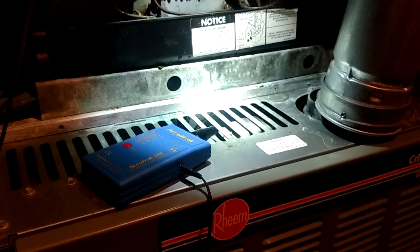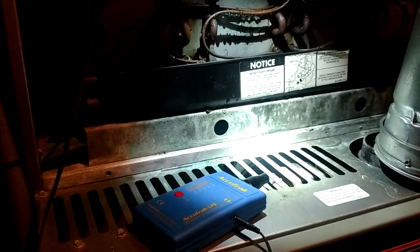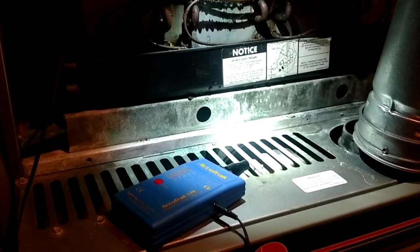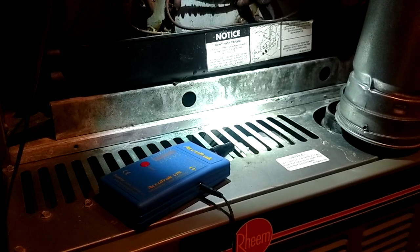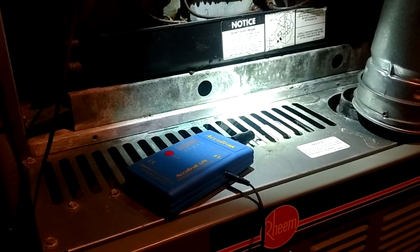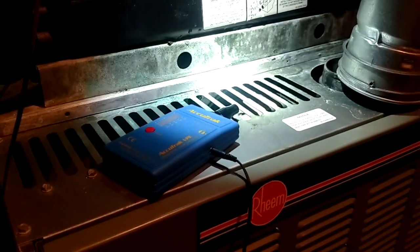It's amazing, and I've already found quite a few. This is the first time I've used it without pressurizing the system — either getting it back up where it needed to be with refrigerant or pressurizing with nitrogen. So I was just curious if it would find a leak on a system this low. A lot of times a sniffer will have a problem when you're down this low on pressure.